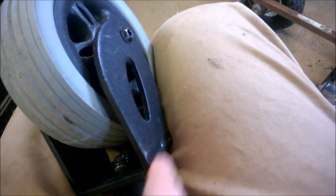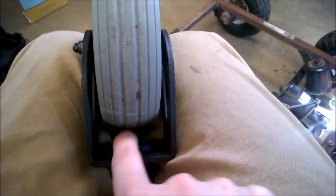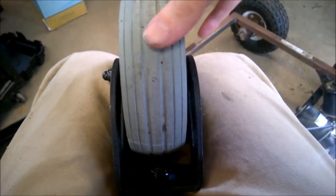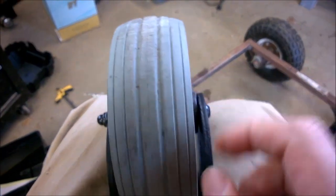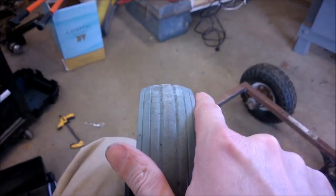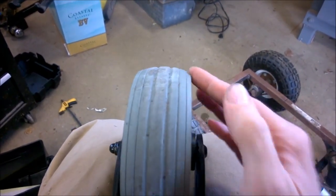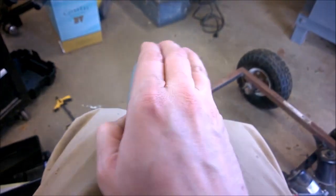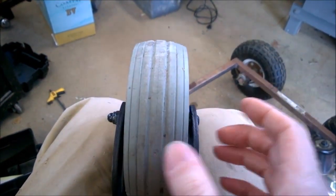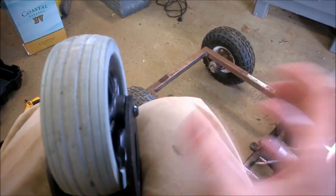It's been a while. The other thing I was thinking is, I could cut these two sides off, right? And then take two wheels and have them right next to each other, butted up, and then just extend this bottom plate. But I don't think it would turn as great as just one. I'm sure of that. And also, when the pivot, you see the crown of the wheel, right? The sides of the wheel aren't going to dig in unless you are in pretty deep, which means that when the crown is right over the pivot, that's why you can turn super easy. If I have two of these, then the crowns aren't going to be over that center thing at all. So you're probably going to have to start moving forward before you can get a turn going.